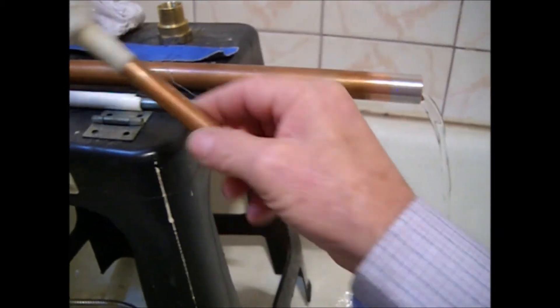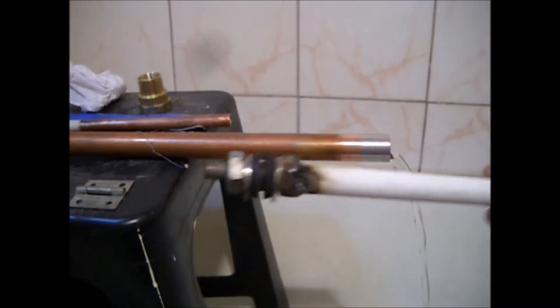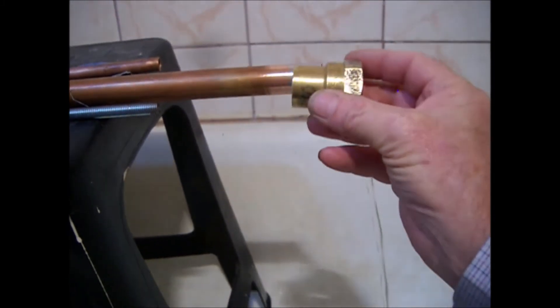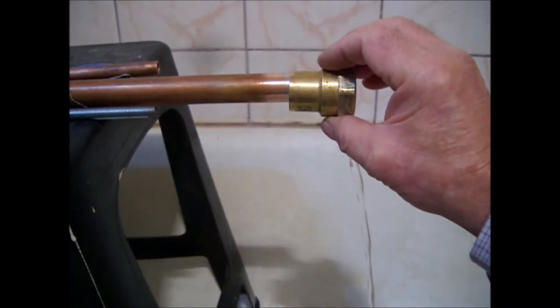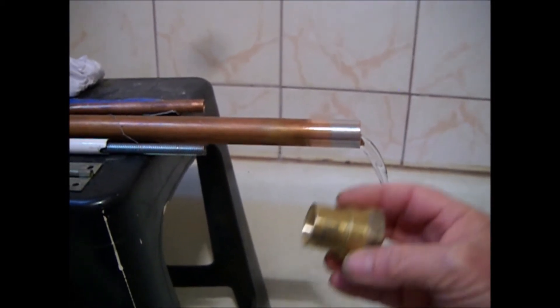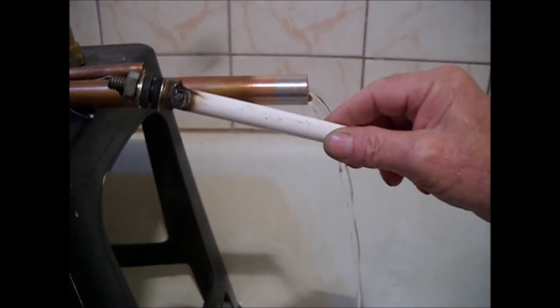These tools — the bypass and the water blocker — can only be used for soldering threaded fittings like this one. We can use them to install a valve, a threaded union, or a stop cap. But we can't install these inside walls, because threaded joints can't be left buried in walls or under floors. So these kinds of blocking tools only let us install threaded joints; we can't make permanent repairs on buried piping.